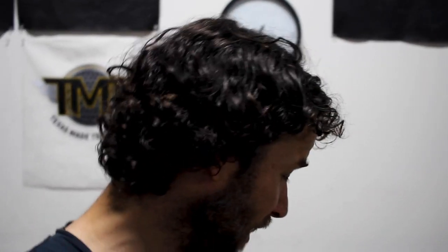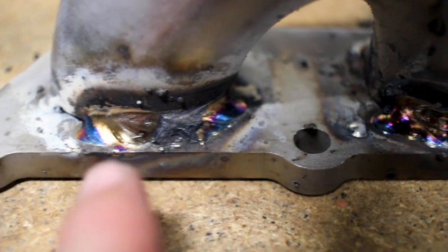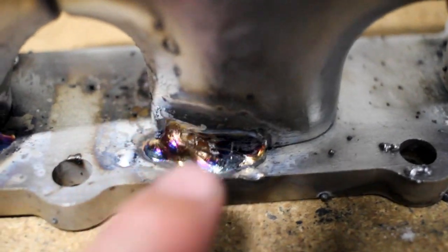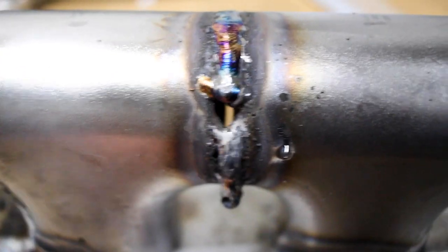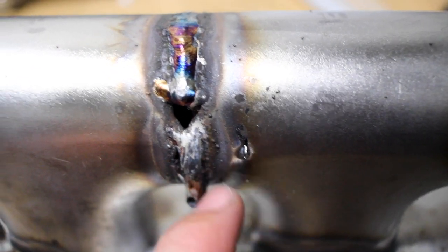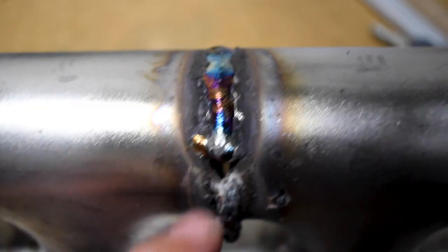That was a good refresher crash course on welding. I had never welded stainless steel either, so it was quite challenging. I went through all my sticks. Let me show you how this is looking — I blew a couple of places out, and then I realized I probably should have flipped this thing over and made sure I was welding flat. I believe this is where I initially started and it looks like there's a little bit of an inclusion here — I'm going to grind that out and redo it. I just could not see where I was going. Same thing here — this started looking okay, but this isn't any better, and then this is when I tried to weld uphill.